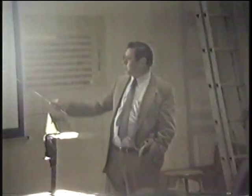Now, why doesn't Beta Movie give you a better picture because it shifts it over here? I can't really answer that question. It's about 1 megahertz more, 5.10. It must be related to the way the Beta Movie does its recording, which is a different system, time compressed. There are other factors involved than just moving the center frequency. But the 550 also time compressed. That is a SuperBeta performance. Sort of. They get 300 lines resolution.